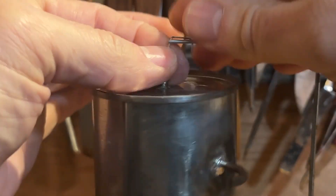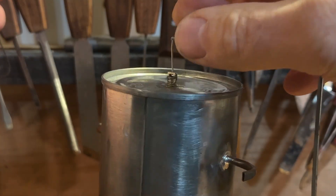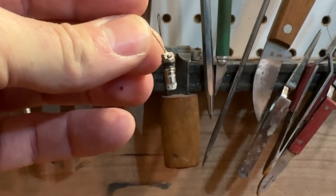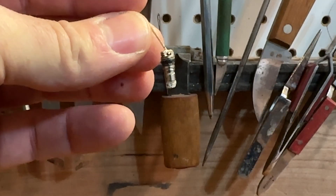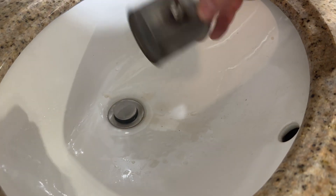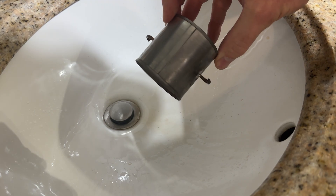Tip five: make sure that the hanger pin is plumb. Tip six: over time the valve core gasket will get hard and no longer make a good seal — replace it or use some glue. Tip seven: over time some brown gunk may clog the nozzle jets. I believe this is the can lining that's burning up. Wash it out.